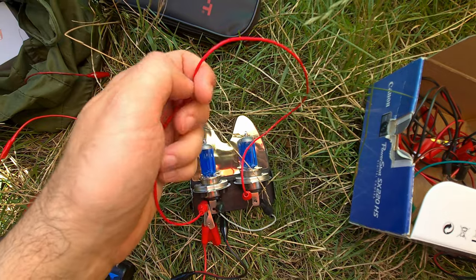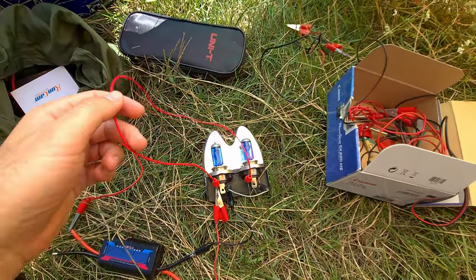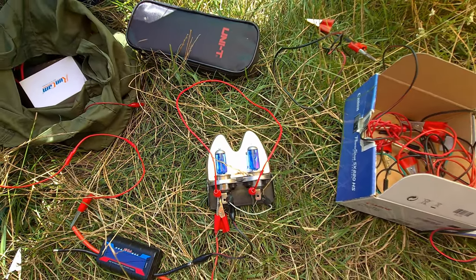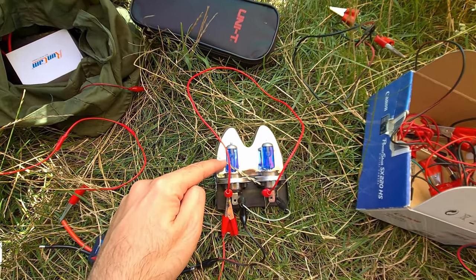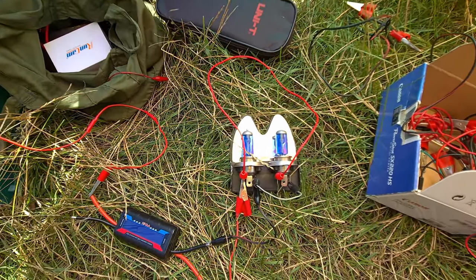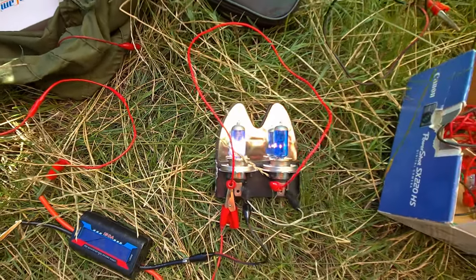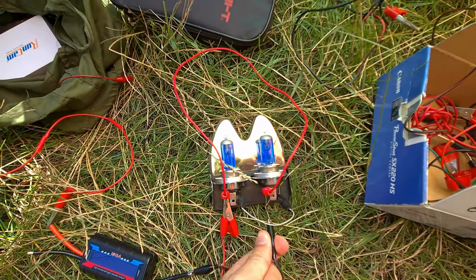This cable is very hot and also very thin. Before replacing it, let's do a test: I'll power not the first bulb but the second bulb, and since the wire is very thin, the first bulb should barely light up due to poor power transfer. Currently the first bulb is being powered and the second is barely receiving any power, as you can see.